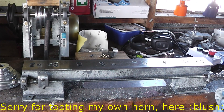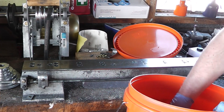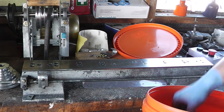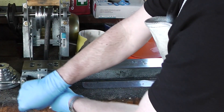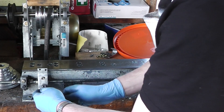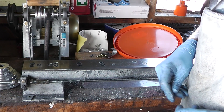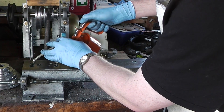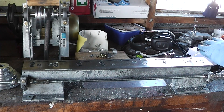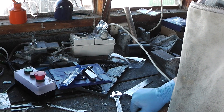I've got a spare empty bucket, I might just put these clamps in here for now, keep them nice and airtight. You never know, I might want some tailstock support again. Didn't take it off before because it made for an easy way to get this to the other end without having to hold the nut myself. Let's put some way oil back on this - aka the hydraulic fluid. I need to tidy up this bombsite, so thank you for watching and have a nice day.